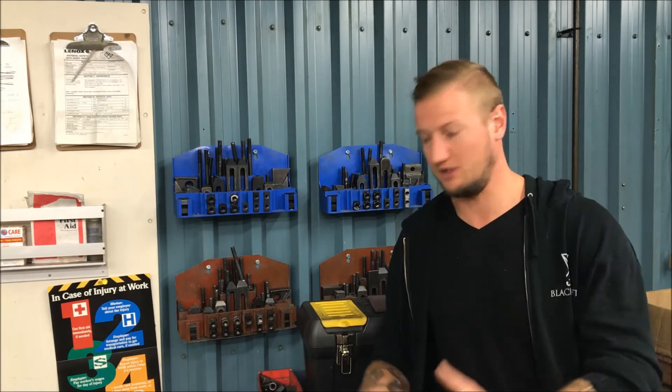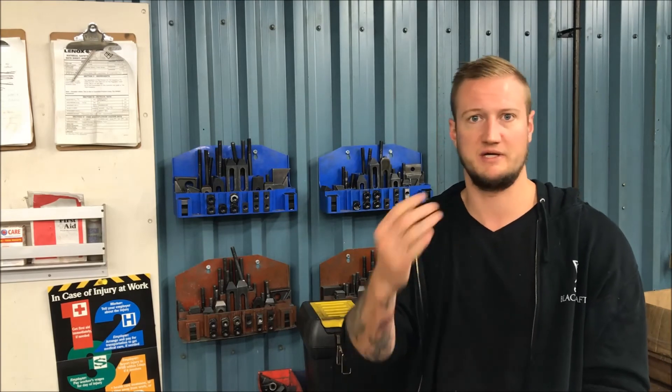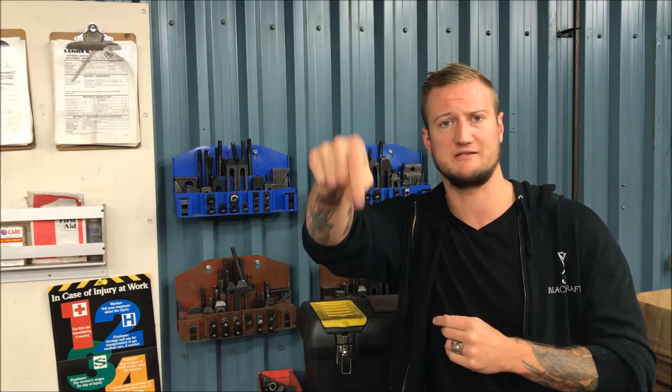A lot of this stuff sounds intimidating if you're just getting into CNC machining, but a lot of it's very intuitive. You're not going to use a vise to hold enormous stuff — plain and simple. You learn pretty quick if you're holding something this far in a vise and you're fly cutting it that it's going to flex. You can turn vices on their sides to hold things sideways. When you get more into things you'll need to get into fourth axis and fifth axis fixturing. But don't be intimidated by it — try a couple of different setups, try making fixturing for things, and ask the more experienced guys at your shop what their opinion is. Thanks very much for hanging out with me. I hope this has been helpful. If you want to see more videos, make sure you like and subscribe.